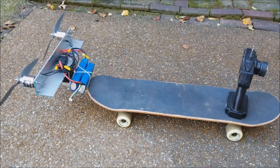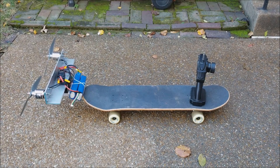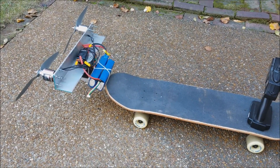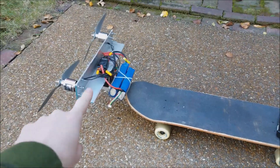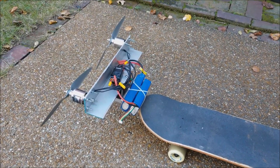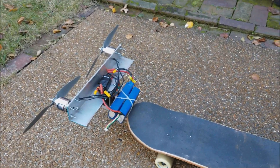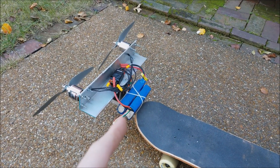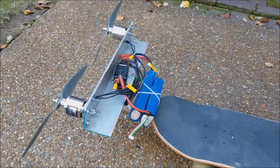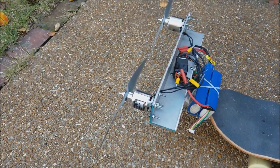This is my new electric build of the wind-powered skateboard. I tried one motor and it really wasn't that powerful, so now I'm at two motors. I already had a setup where two ESCs are wired in sync, and I had an extra motor and extra prop, so I made a nice big L-bracket that spans far enough to hold the two motors apart and bolted it right onto the main square tubing like my last setup. It was a pretty simple modification — I took out the gas tank, put in two LiPos, my servo, and my ESCs. I used the additional mounts for the motors to mount the props on the back side instead of the front main shaft.